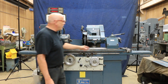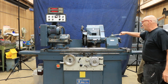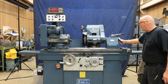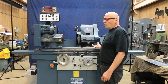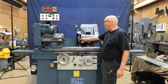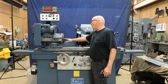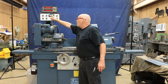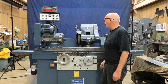So this is a heavy-duty tailstock, 50 kilograms or 100 kilograms maximum. Also has a lock in place like you find on a bigger machine. So this machine's currently wired for 440 volts. It's got a 12-inch diameter grinding wheel that will have a 5-inch diameter bore. You've got a live and dead center type workhead, variable speed. We can adjust the speed, and also it swivels to different angles and different degrees.